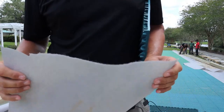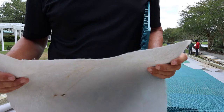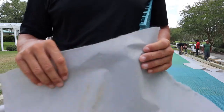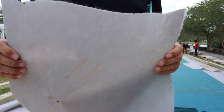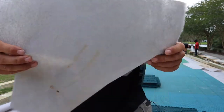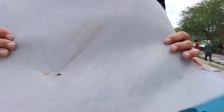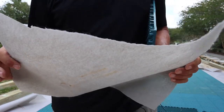Now, it's important to use like a commercial grade fabric. So this here is a polyspun. It's plastic, but what it does, it allows water to permeate through. But what's nice about it is it's extremely durable, and can be a little difficult to cut sometimes, so you want to make sure you're using a good sharp razor or scissors. But how this works, it's very similar to taking saran wrap, which in and of itself is inherently weak.